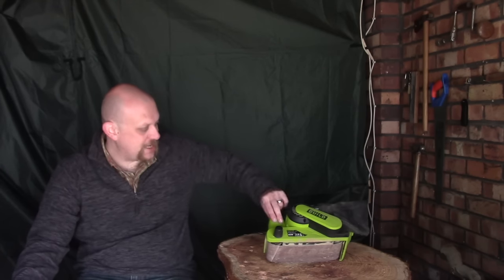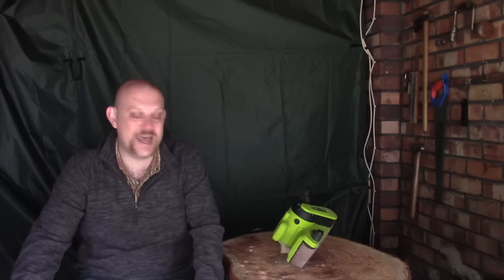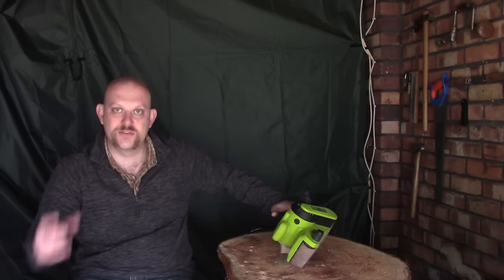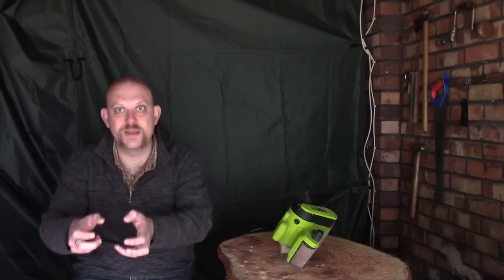Just off camera I've got my little bench vice, and there's a nice little piece on the front of this sander for steadying it while you work. I figured maybe that will fit in there — I haven't tried this yet, so this is a first attempt on camera. On the back there's a little trigger that turns it on and off, and a little switch next to the trigger, so I can pull the trigger, press the switch, let go, and it will carry on running until I press the trigger again. That means I've got both hands free.